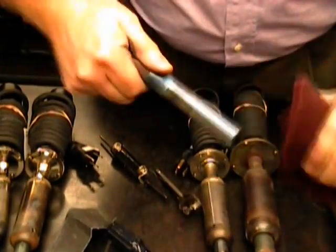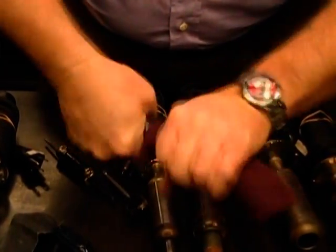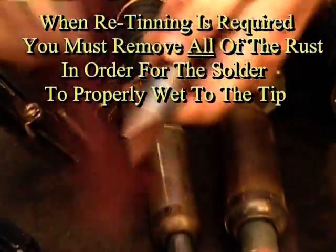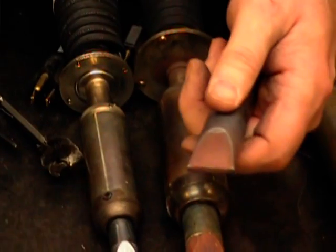But how are you going to solder with that oxidized tip? I'm going to keep cleaning — I'm going to clean the head of it a little bit with this pad and try to remove a lot of the junk from there. You can see that's coming off pretty good; I'm even getting some of the rust off there. But that's really not going to take all the rust off like you need in order to re-wet it. The pad just is not going to be aggressive enough.